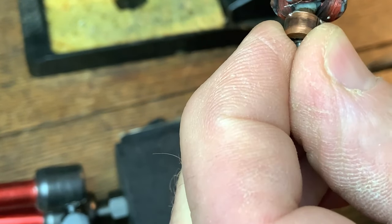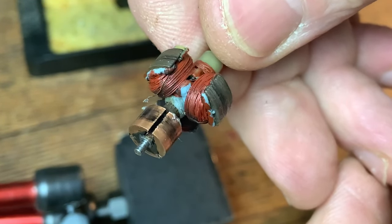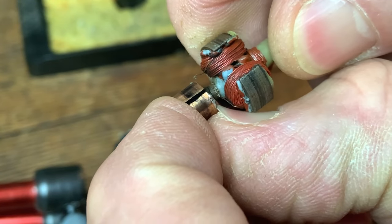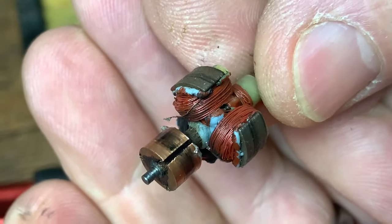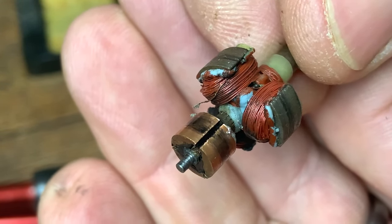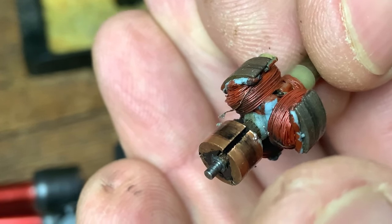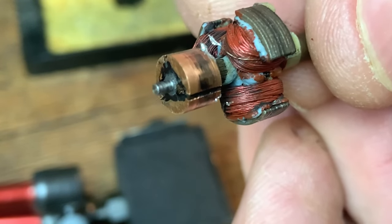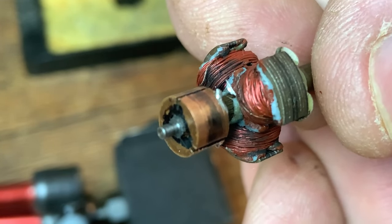Even though it's split, I bet it's going to be very tight. I'll get my fingernail behind it. That's on very tight - it's almost shrunk onto the shaft. I think the properties of the inner parts of the commutator have changed over time, getting tighter and tighter, and it's opened up. I must make sure I don't damage the windings. I'm going to pause the camera and see whether I can draw it off.